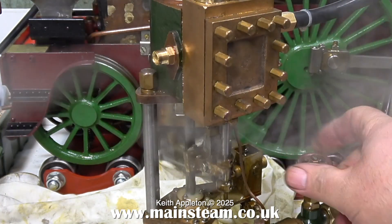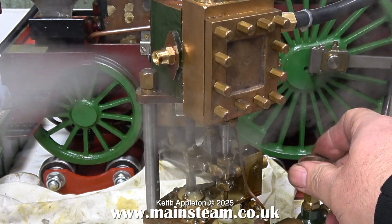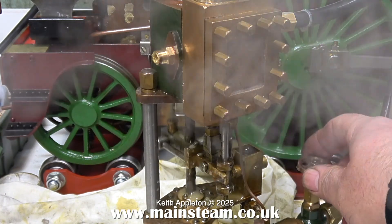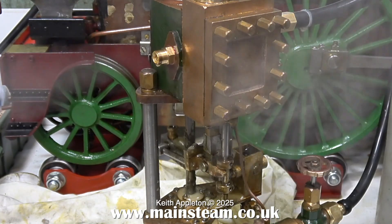As you can clearly see, there's a lot of steam coming from the bottom gland on the steam cylinder — that's an easy fix. What I'm currently doing is closing the water valve a bit; this will simulate the engine pumping against pressure, and you can clearly see the jet of steam now issuing forth from the gland. I like working with steam engines — they're just so incredibly steamy.